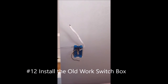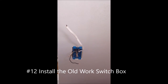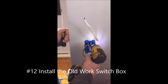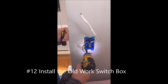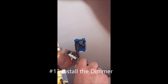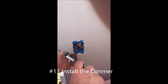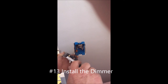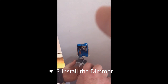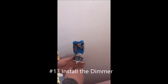Alright, you've got the wires in. The box fits snugly — that's what you want. At this time you see the two screws on the opposite ends of the box; you screw them in, just like the cans, and the actual flaps tighten to the drywall, which is what holds the box in place. Step thirteen — we've got the old work box installed and connected the wires. All the old wires color to color now become your hot wire. All the neutrals get tied together — they do not connect to the switch. And then our new black wire from the recessed cans goes on the opposite side. Basically all you're doing is breaking the circuit with the switch connecting the two wires. We'll screw it in and then put the wall plate on.